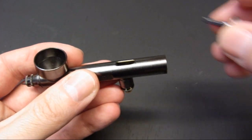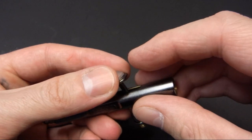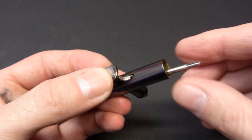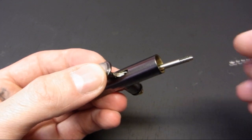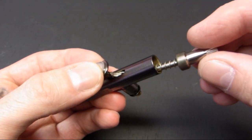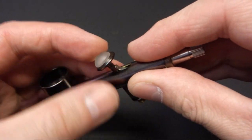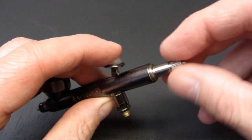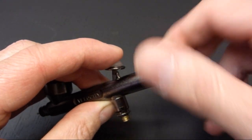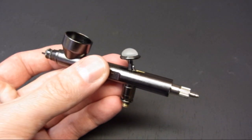Now we'll move back round to the back. Insert the trigger — just make sure that it's sitting on the air valve. Now we're going to insert the trigger rocker lever; just make sure it goes into the slot and up against the back of the trigger. Trigger spring next. When you insert this piece, it's advisable to push the trigger back so the spring won't bind up and everything will be aligned. Just screw that in — not all the way, just a little way into the body, so there's enough room for the handle to fit on.